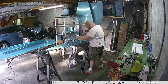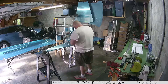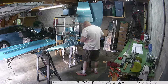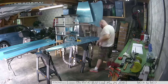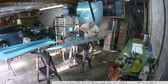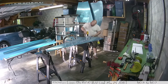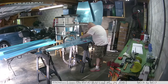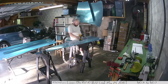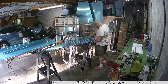One thing to note: I used a cleco in every single hole here, though actually I'm doing every other one first and then going back to fill them all in. Either way, you don't need to put clecos in every hole — every other hole is reasonable. The reason I say that is because I had 623 number-40 clecos and I used every single one of them. I was actually going back and harvesting clecos from other areas. There are a lot of holes. You could easily have 1200 clecos and still use them all if you put one in every hole. So just know that you probably don't actually need to do every single hole when it comes to clecoing — though of course you do need to drill every single hole.